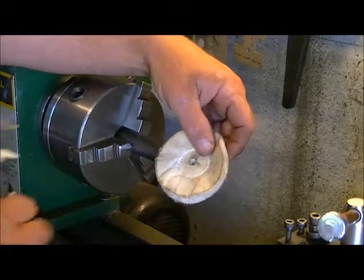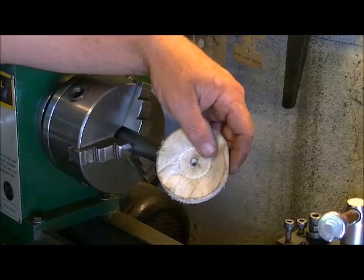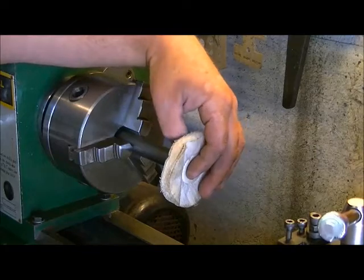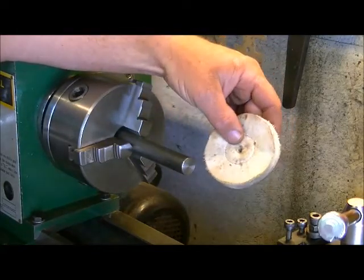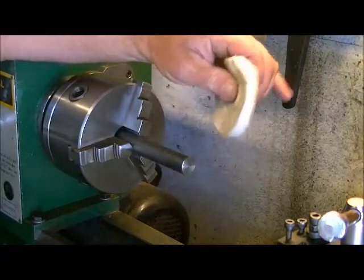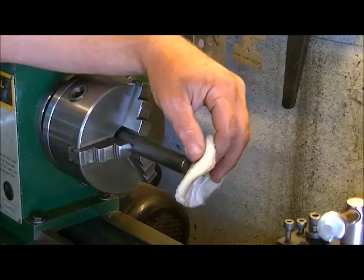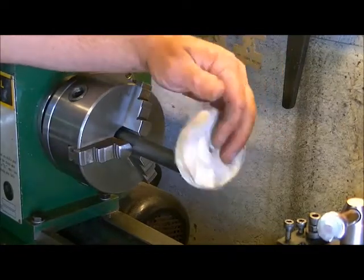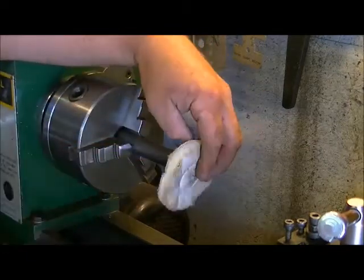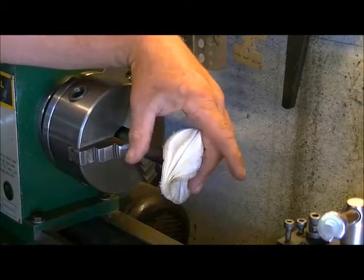Okay, you're going to need a bolt that's going to fit in the hole reasonably well without too much play, because you want to make sure everything gets centered nice. Now, because I'm using 3/4 inch, I'm actually going to use backing washers on the front and the back, just to keep that area nice and rigid, which is also going to prevent it from tearing off on me too, because without the washers it can tear off, and you should actually go with a washer diameter of this size for maximum secure hold and best results for when this thing starts to fan out when you're buffing.